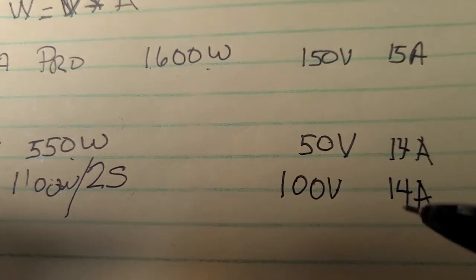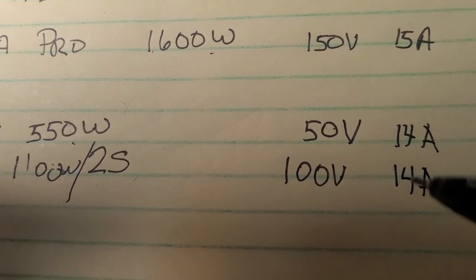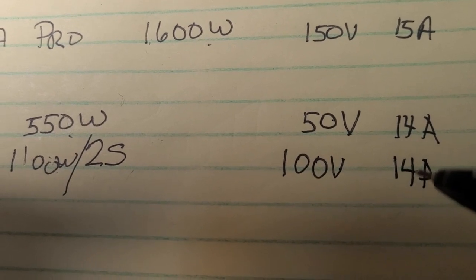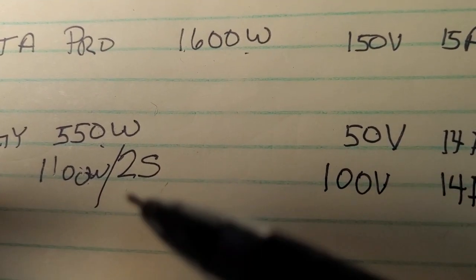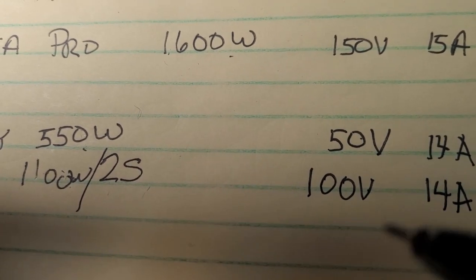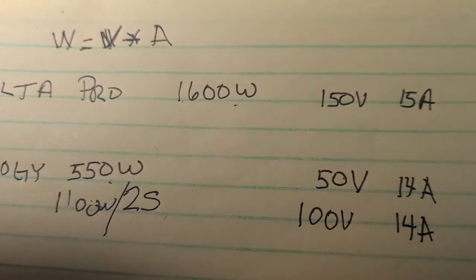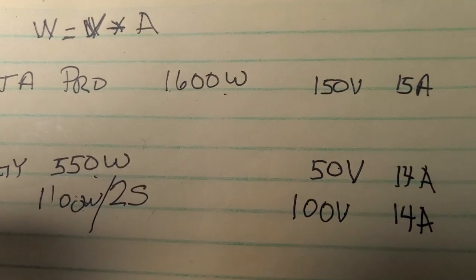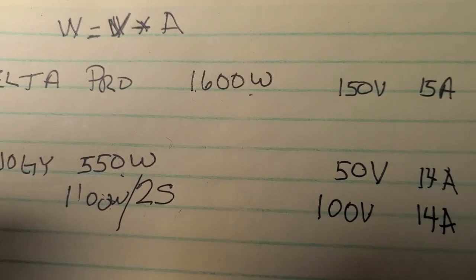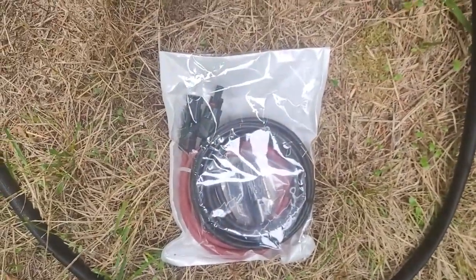If I wanted to improve this, I'm getting 900 to 1000 watts now. I could try to get closer to 1600 by going up a little in voltage, still staying under 150, or going up a little in amperage. On a cloudy day you're not making the max amps anyway, so having more amp-rated panels would help on cloudy days. I'm kind of playing around with numbers and trying to decide where to go next with more solar panels, but it's not going to be anytime soon.